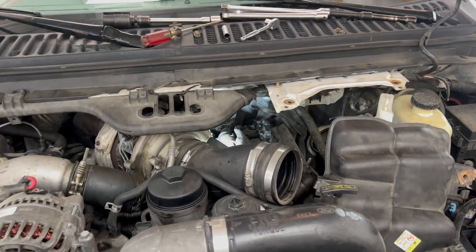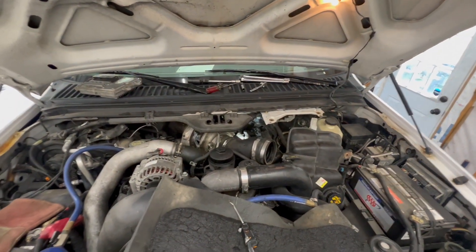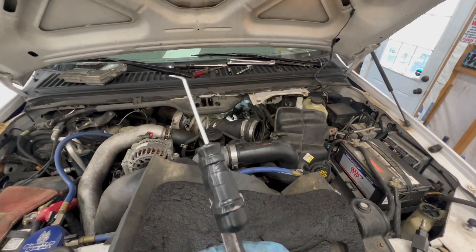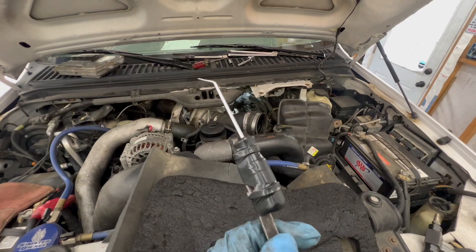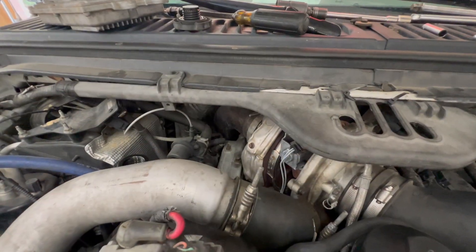So now I get to get up here and not burn myself, get the IPR pulled and air tested. We got the IPR back down and it's still sitting down there — the screen is stuck in there. It's still really hot, so I can't get a pick down there to get the screen out. What I came up with is just taking a pick, zip-tied it, electric-taped it, and that'll grab the screen and allow me to pull it out.